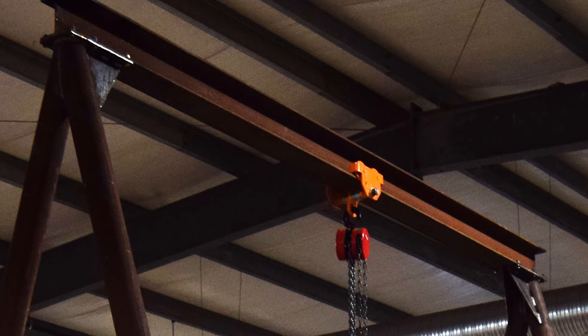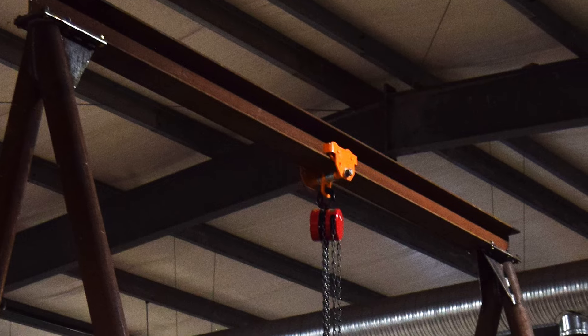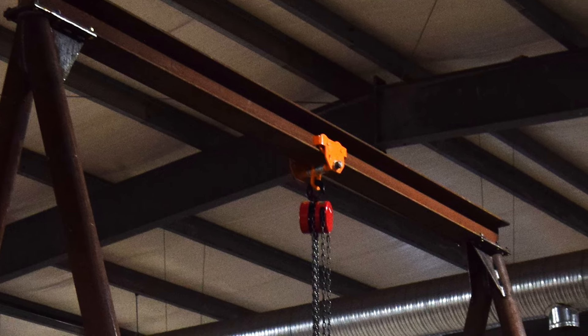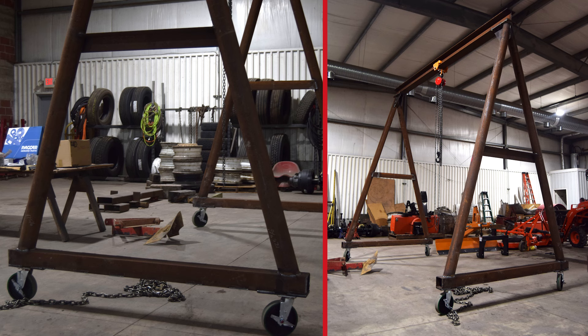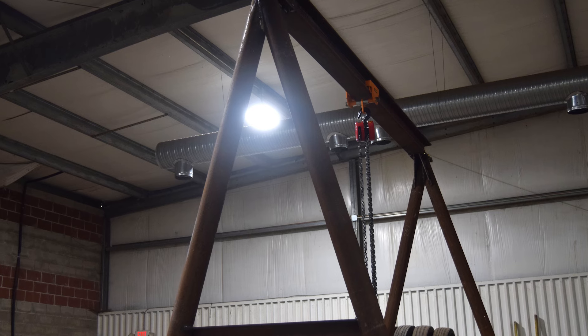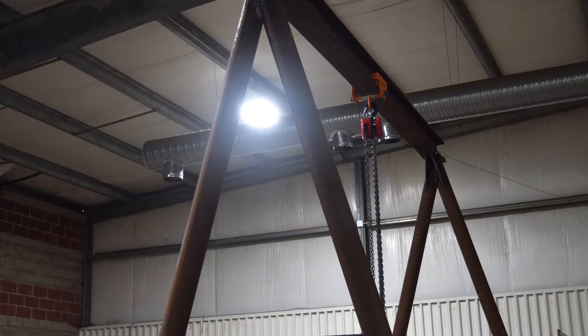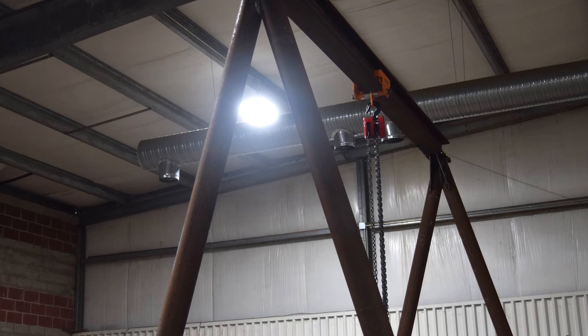The trolley and chain hoist were items from Amazon — we've got almost as much in those as we've got in the scrap. To get our pipes to fit up right and make our A-frames, we used a chalk line, drew our template on the floor for fitment. There's about a sixteenth of an inch difference in height from side to side — almost as close to perfect as you can get with a chalk line and a concrete floor.